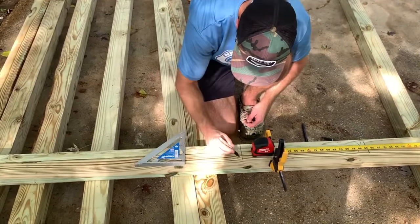So what I'm doing is I'm applying two beads of this asphaltic coating, and I'm doing this on both sides of the piece of ridge flashing. This asphaltic coating will help to adhere the ridge flashing to the shed, and it also will be a waterproofing agent. Continue to apply this asphaltic coating on both sides of the ridge flashing all the way down the entire length.